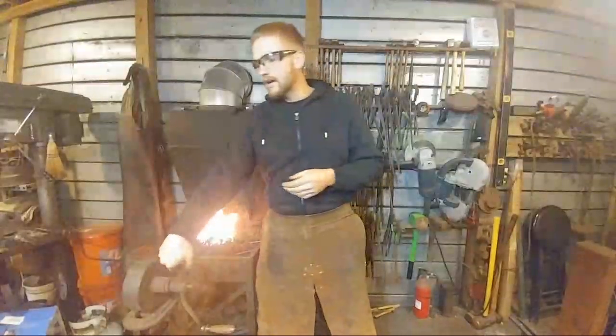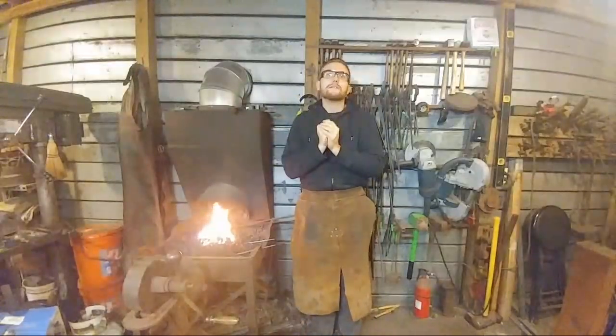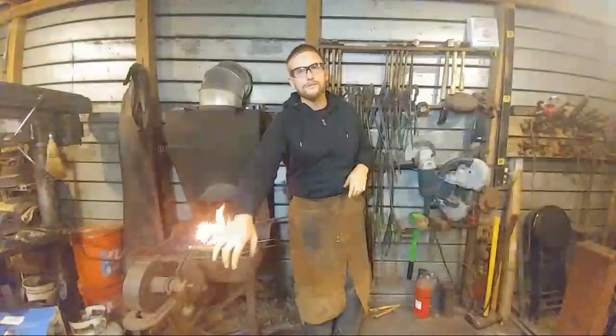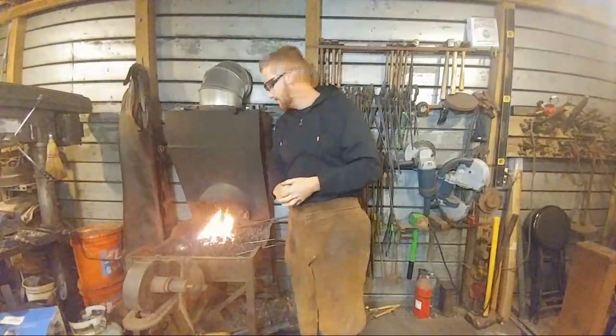Charles Fahrenholtz asks, have you ever known anyone that's used a brake drum from a semi for a forge? Yeah, there's a lot of people who use brake drums out of semis for a forge. It's really deep, so you need to build it up. But a disc brake rotor makes a better forge insert, and then you build a body around it, better than a semi brake drum.